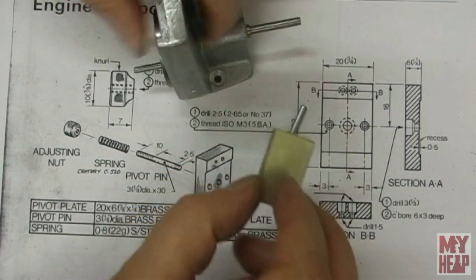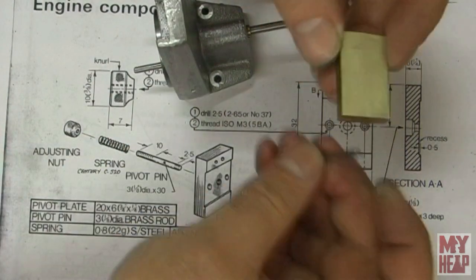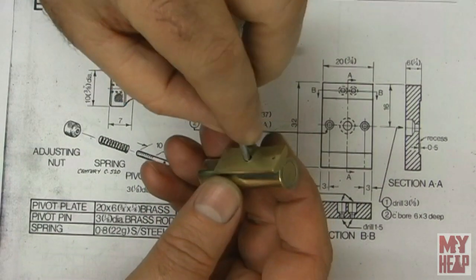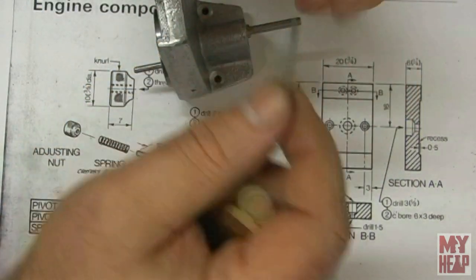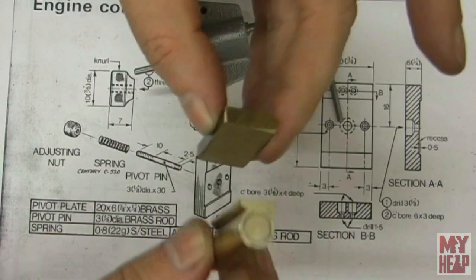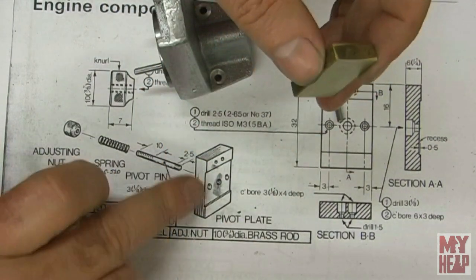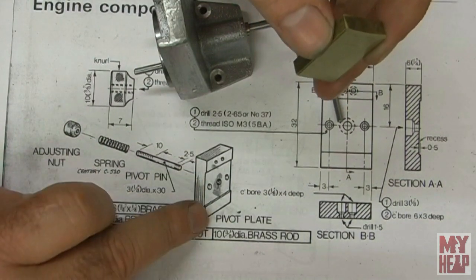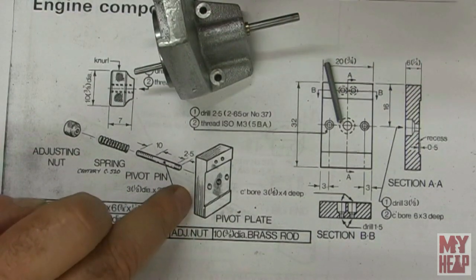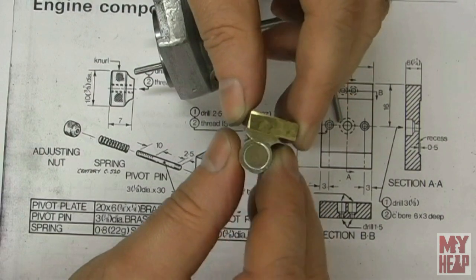Let me describe what this is. This block has a relief in it — it has a clearance hole for this pin to pass through. The small thread on one side of this pin will thread into the back of the cylinder. It passes through this block, and with the spring and adjusting nut it pulls the cylinder against this block tightly — that will be the pivot face. To reduce friction there's a little undercut here in the middle, about a half a millimeter, leaving a raised edge. That undercut reduces the friction area that the cylinder has to pivot on.